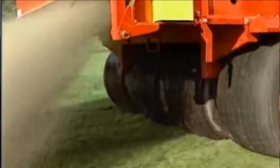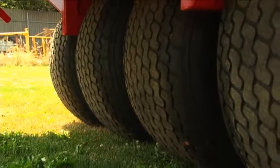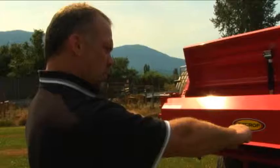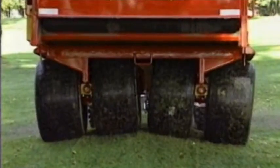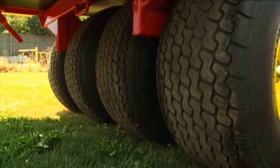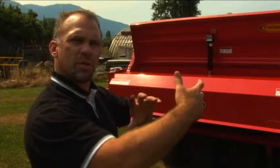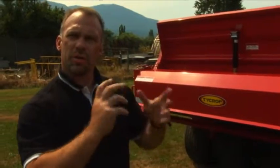The TD460 is mounted on four large flotation tires on a four-wheel walking beam axle. The wheels will actually adjust to different configurations, different humps and dips, so that all the weight will always be spread over all four wheels. Each hub is independent of the other three, and the inside wheel will turn backwards so there won't be any ripping of the turf if you're turning sharp.